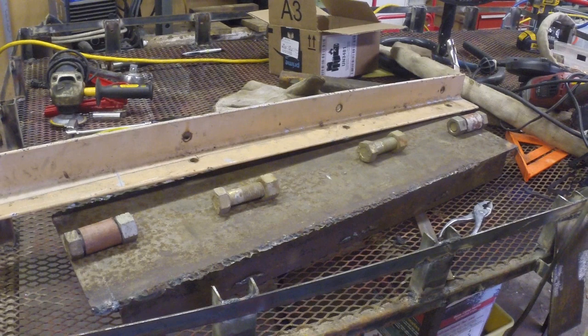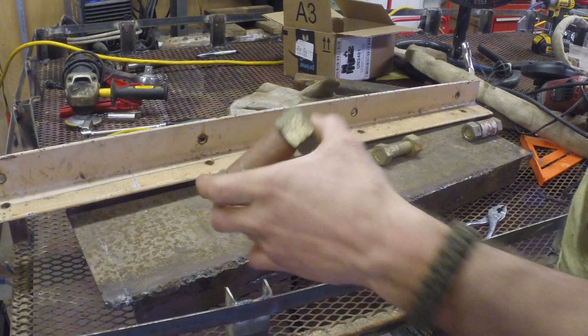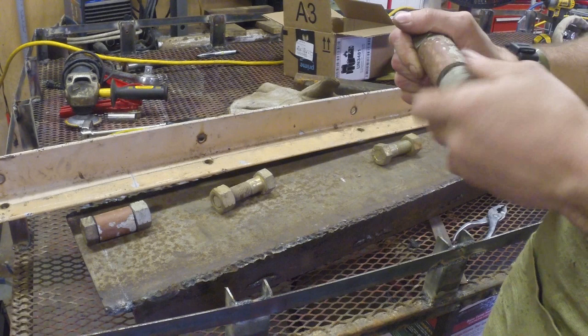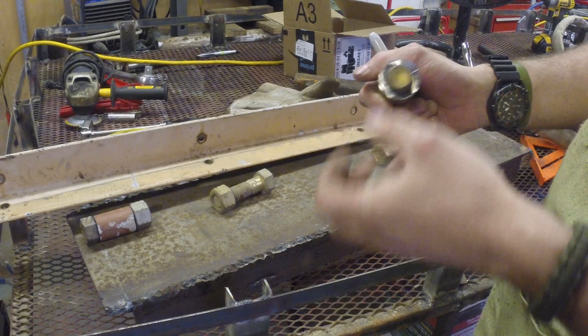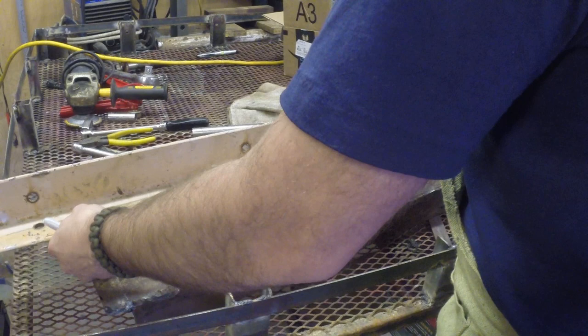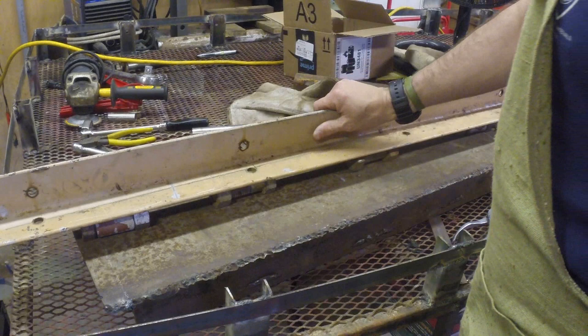What I'm doing is trying to explain this without too much of a visual. This piece right here is going to mount down on the bottom side of the bed. I'm making hinges out of these big grade 8 bolts and this pipe to make the hinges, and I want to drill and tap them and put zerk fittings on there. Then I'll weld them together — this will go on the frame and that will be the hinges. I'm going to cut two more of these out and try to get them tapped.